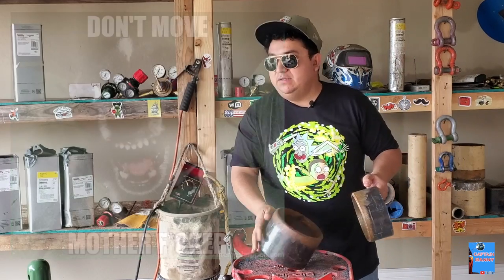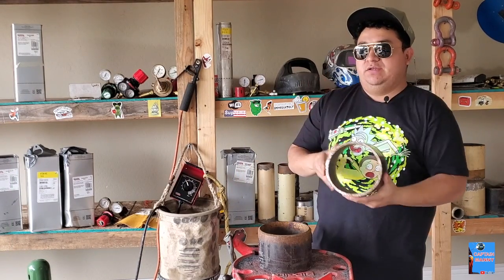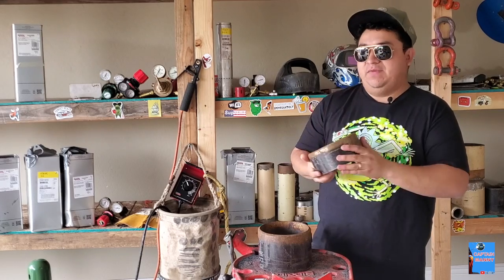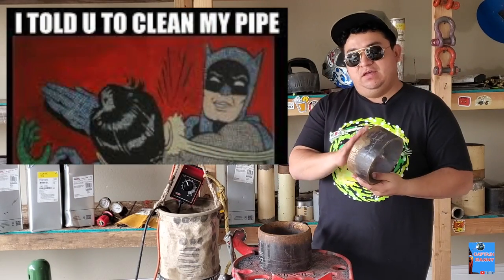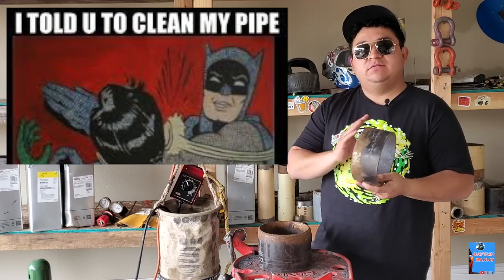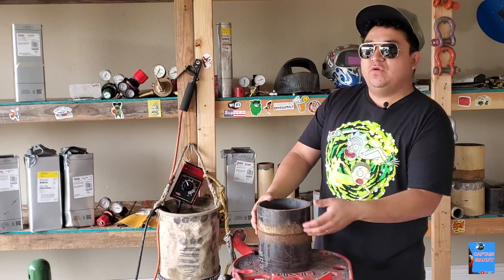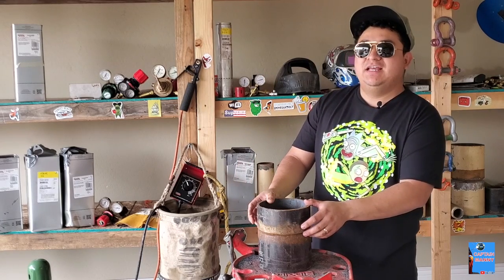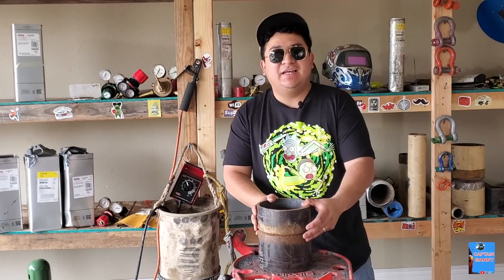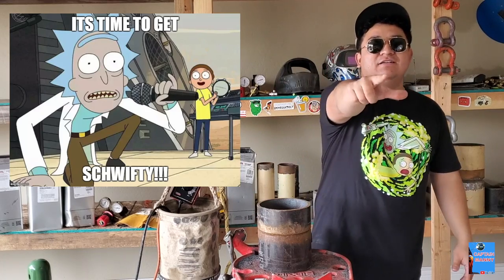All right, so we're gonna use a 6-inch pipe. This is a schedule 40 pipe. We're gonna clean this pipe real good, do a nickel landing on it, and bevel it. We are gonna use 6-10, 1/8 for the root. Probably gonna do 6-10 for the hot pass, and then we'll probably cap it with 80-10. So without further ado, guys, let's get it done.